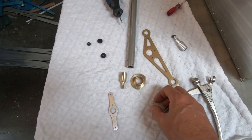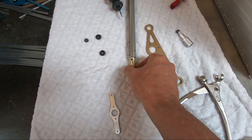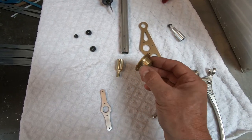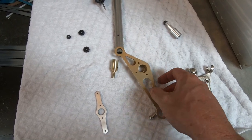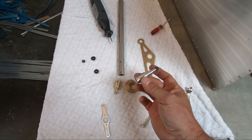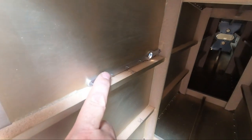I've got a few more steps done on this bell crank assembly that goes in the forward part of the aft fuselage. I've got all the holes drilled now for the part that gets riveted on the bottom that slips inside the tube bolted to the bottom. I've also got the assembly drilled not only for the rivets that go through the side of the tube but also the three holes that mount on the top and get pop riveted to the bell crank. What I'm trying to do is get enough assembled to determine the exact length to cut this tube to install the upper mount, and also get the bottom bracket installed in the fuselage.